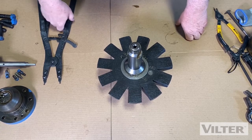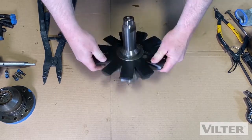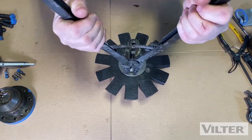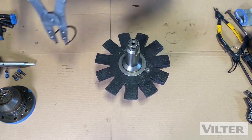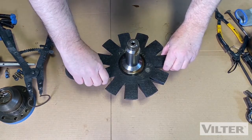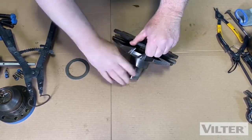Now we're going to look at the gate rotor assembly itself. Remember we have the gate rotor blade and the gate rotor support which gives strength to the blades themselves. I'm going to remove this ring — there's a washer underneath — and now we can remove this blade. There will be some oil that will be holding it in place.